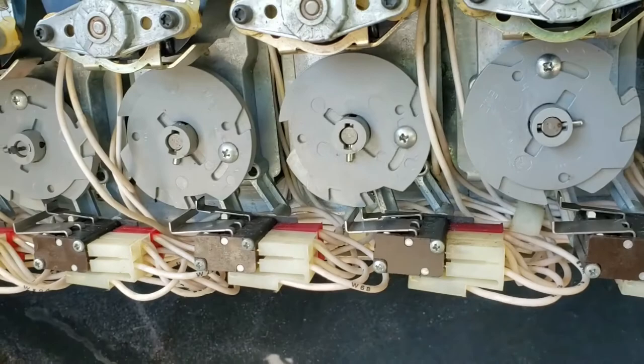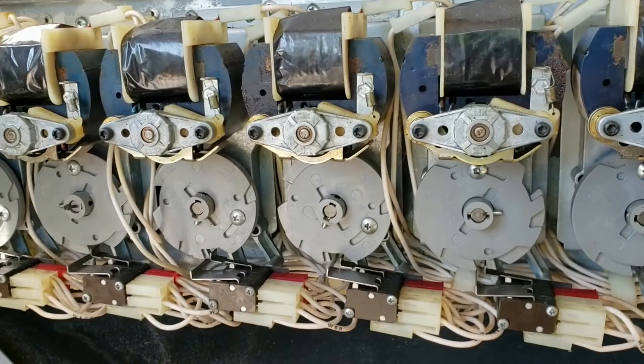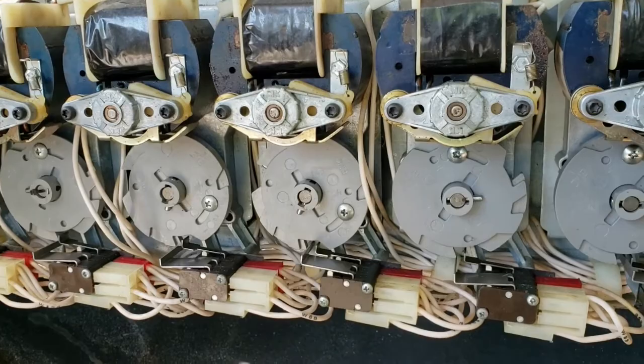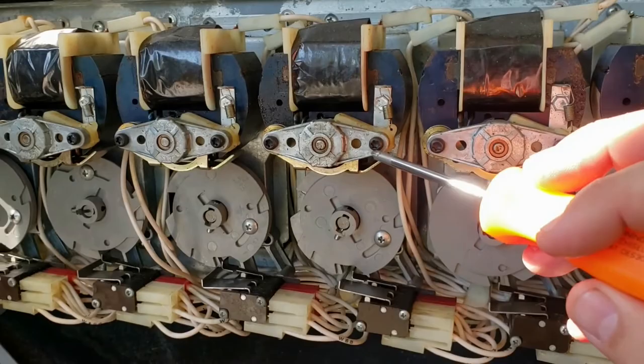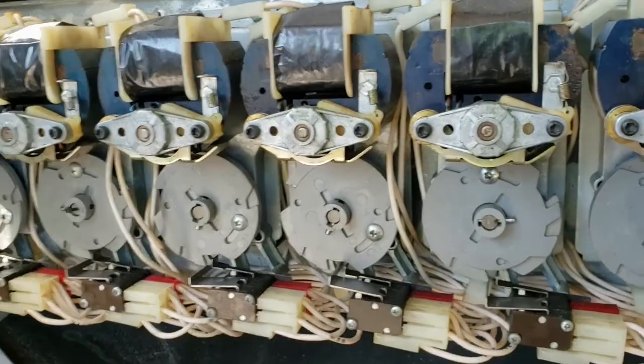Let's look at number six, where they're both down in the channel — and they both click in again. If we zoom out, you can see that park gear just falls into place after it had already stopped. That's not how it's supposed to work. I'm going to take all of these apart — definitely number six — but I'm going to clean this whole assembly. It's probably just gummed up, stopping this gear from popping back into place when it's supposed to.